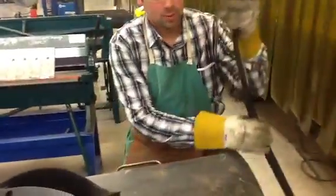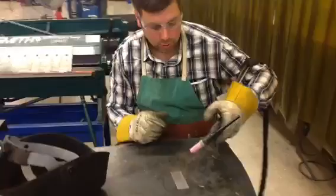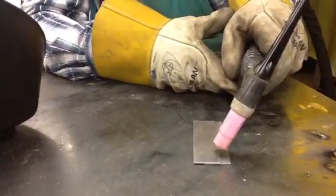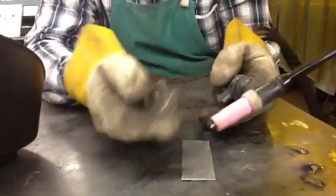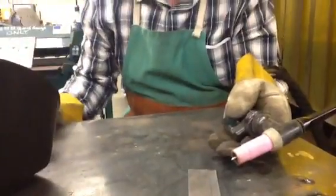I've already got some metal set up here, and I've got a stool set up so I can be comfortable. Now I'm left-handed, so I'm going to get my torch like this — I might even throw the cord over my shoulder or over my arm so I don't have to hold that weight up. I'm going to get myself in position so I can weld pretty much vertical. My heat is going to go right into this lap weld, and I'll just work this back and forth to weld the joint together. I might spot one side, stop, dial up, then spot the other side, because otherwise it's going to warp apart. What we're going to ask you to do is just a simple lap weld like this, without filler rod, to start with.